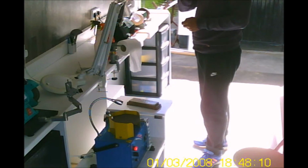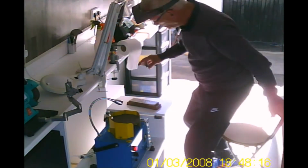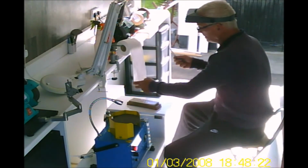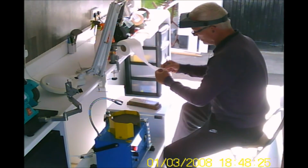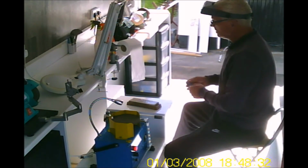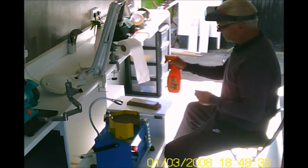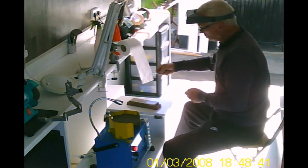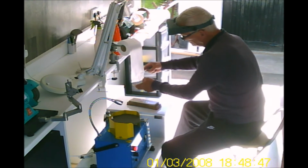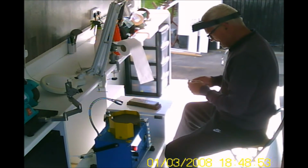We would then reassemble the scissors, and we would then come to our test area where we would do a dry cut, check that everything is cut and right. Then we would do a wet cut. Basically what we'll do is we'll separate the 2-ply tissue again with your blades set back and adjusted. We will then do a spray test on here and test your scissors for sharpness on here. We are looking for the cut from the back of the blade right to the tip and away without pulling any tissue. That way we know your scissors are good.